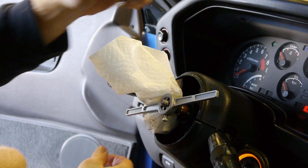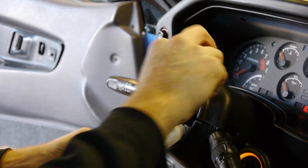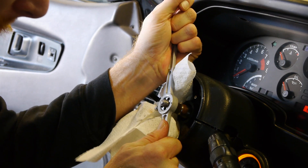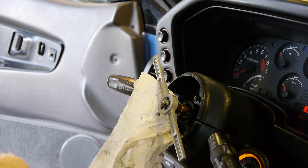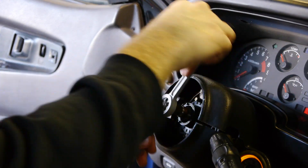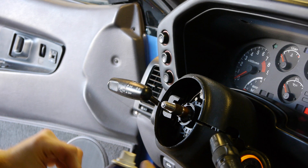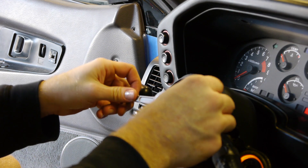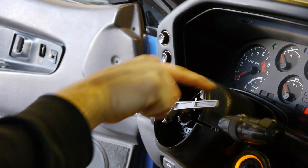I can actually see now that I'm on the last bit of threads that are good, and it's getting really tough to cut. And I think I just bottomed out. I was at the very bottom. So time to back it out, chase it again a couple times. I'm going to back this all the way out, spray it down, and then chase it again. Well, there are some threads on there — not as many as I'd like, but I think it might get the job done. So we're going to go ahead and do this again.